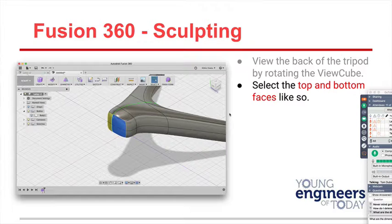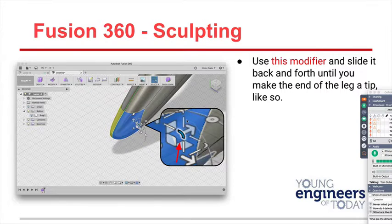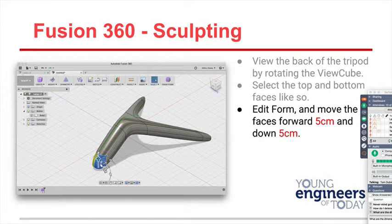Again, select the top and bottom faces this time. Edit form and move the face forward 5 centimeters and down 5 centimeters. So you pulled this out, you lessen this a little bit. And you can modify this thing a couple times. And you can use that to make the end of the thing look kind of good. So that's going to make it 5 centimeters.